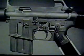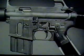Now, one final action is required to complete the cycle: locking. The forward movement of the bolt ceases when the bolt locking lugs pass between the barrel extension locking lugs and the round is fully chambered. When the bolt carrier enters the last half inch of its forward movement, the bolt cam pin emerges from the guide channel in the upper receiver, moves along the cam track, rotating the bolt counterclockwise. This locks the bolt to the barrel extension. Locking the bolt completes the cycle of operation. The weapon is ready to be fired again.